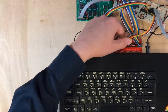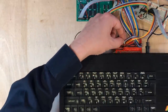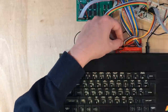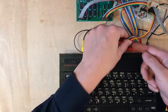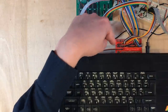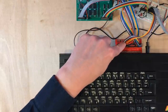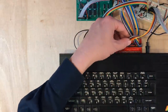Right, so the top bit here almost shouldn't come into it at all. It's got D012. That's the purple line, the grey line, the white line. Those are going to the right locations. So I'm working on the theory that I've got the data lines kind of swapped around from what they should be. Now the top bit is always zero in both the right and the wrong data. The next three bits I've definitely got right, and the bottom three bits of both the correct and incorrect letters on the output are correct.